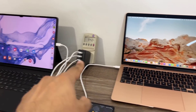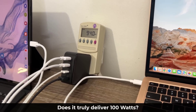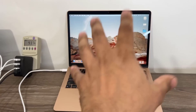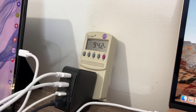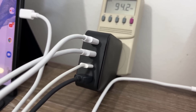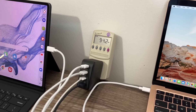I brought in a bigger tablet and added a laptop to the charger, and I have two phones charging as well. The charger is plugged into a meter that tells me how much wattage it is actually pulling from the electrical outlet. With a huge tablet, a laptop, and two phones, this charger is charging all of them at the same time and it is pulling almost 100 watts of power from the outlet — distributing that to all these various products.